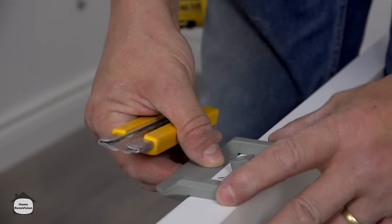Now it's time to mark the hinge locations on the other door. Let's get the pins in — we're just going to lift this into position and get the hinge pin in place. Now our door is hanging on the hinge at the top. You want to just pull this over, get it to the same location as the one on top — roughly one eighth of an inch inside — and make your marks. Then take the door off and chisel out those two hinge locations. That is the best technique I've ever found for getting perfect hinge locations.